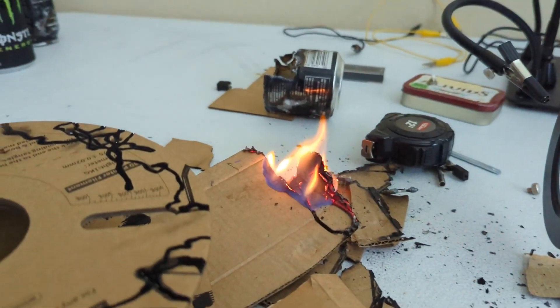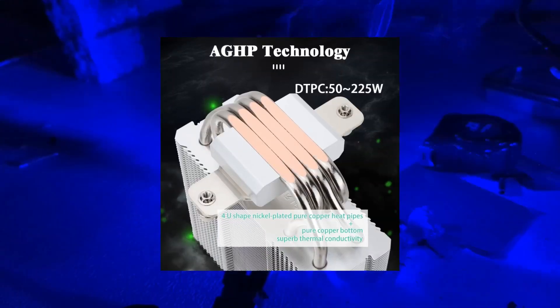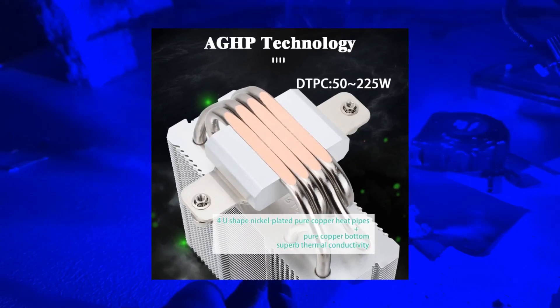The great thing about knowing how much thermal waste you're generating is that you can scout the landscape to see what kind of heatsink you need to cool your laser. Since you're dealing with about 200 watts of thermal waste, this is right around the range of overclocked CPUs. So I started scouting for higher-end CPU coolers, and lo and behold, I found one that was perfect for this project. The heatsink was rated for up to 225 watts of thermal waste. The question then remained: how am I going to keep the laser module attached to the heatsink? The heatsink is designed to mount to a CPU, not necessarily a laser diode array — and ironically, this is where 3D printing came into use.